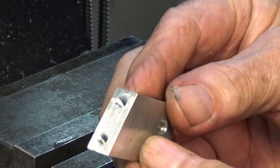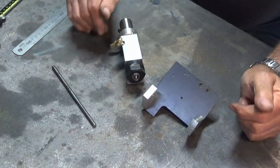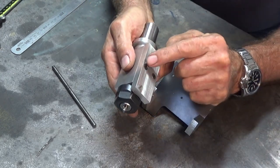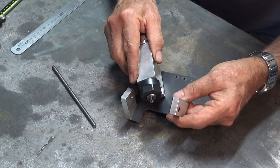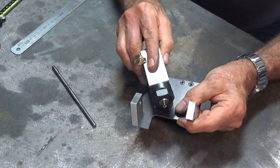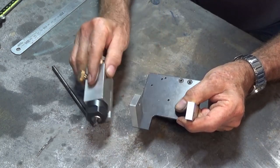Okay, I'll get the other one of those done and then we'll assemble the gantry plate to this point. I think we need to finish up this episode today. Now, what I've done is I've shortened the dowel pins on the bottom of this plate here so that when we push it through the holes in the trunnion plate, we don't need to push it quite so far. So it just sort of snugs down like that, and it means that you can remove it fairly easily and check it, put it back if you need to.